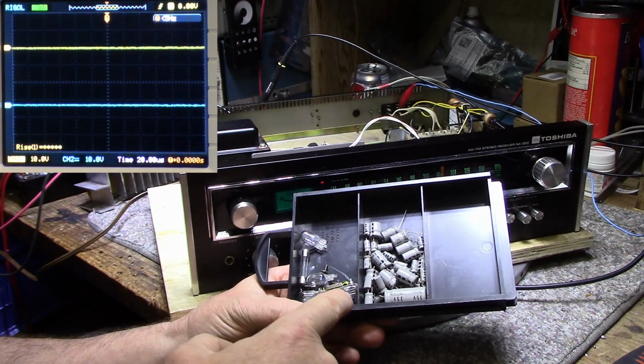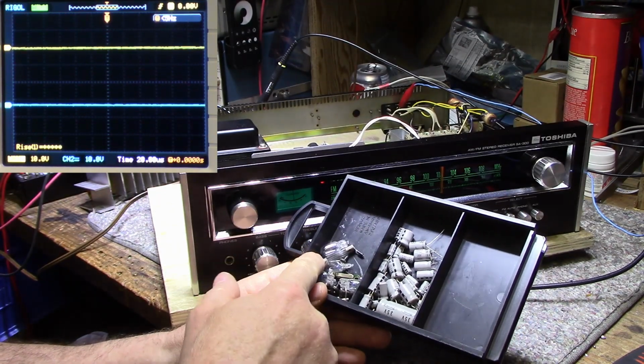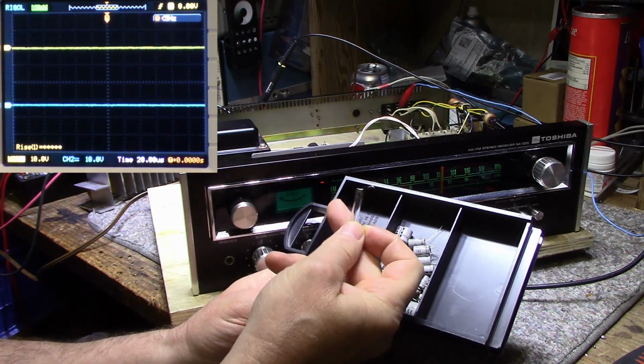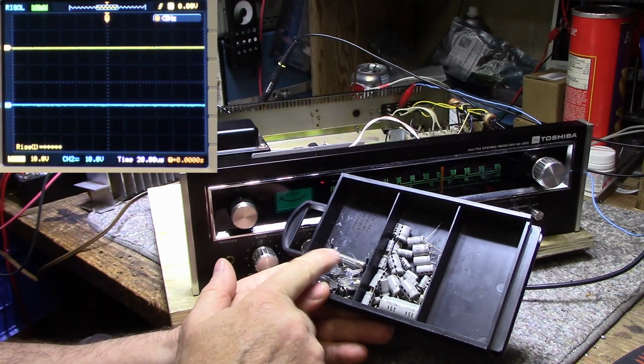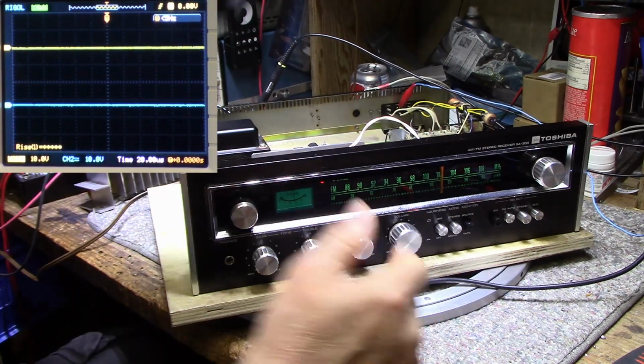Two of these 4 bulbs were burned out, and that one fuse there, in my stupidity, I put my power supply across the lamps, and it was backfeeding power to the transformer, so that's what popped the fuse, so I had to replace that. Other than that, it's all done.